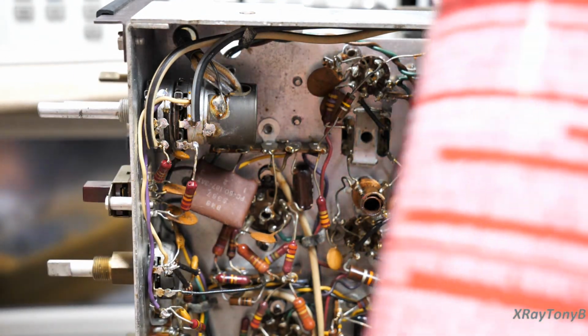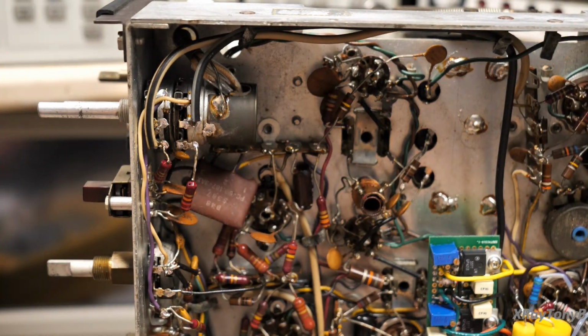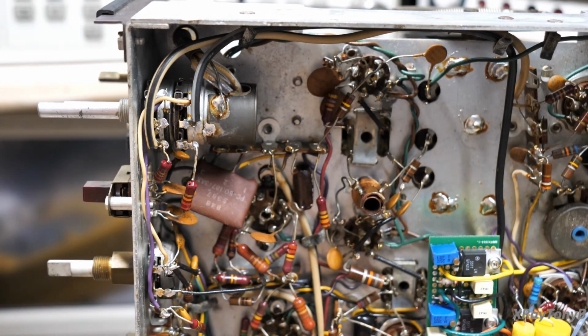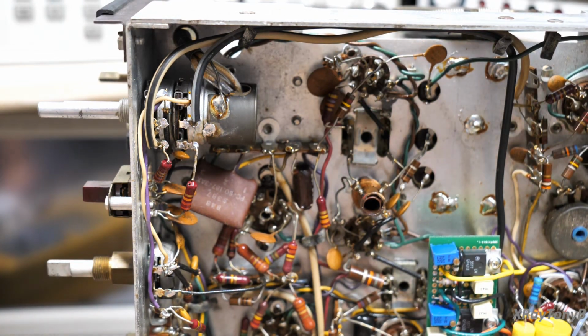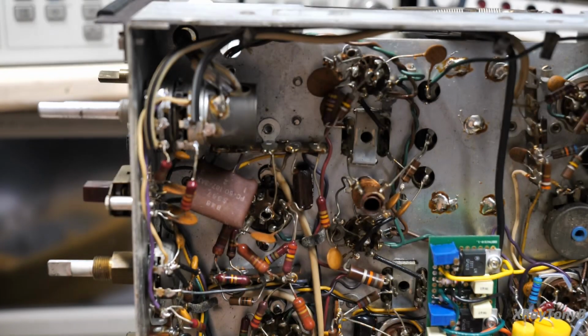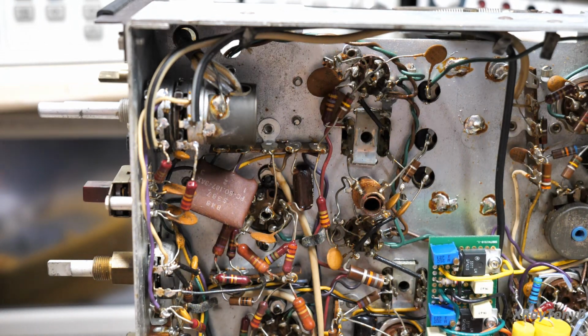It just washes everything out, and that will clean out the pot. It'll get rid of all that friction grease as well, so you have to watch that. But it will clean all the crud out. Sometimes when somebody really hoses these things down with the red DeoxIT, this just can't get it all out. And then you have to do what we just did in this video. Hope that makes sense.